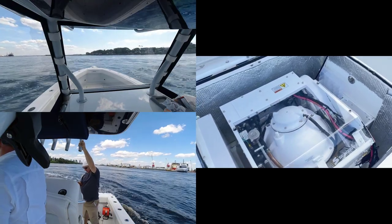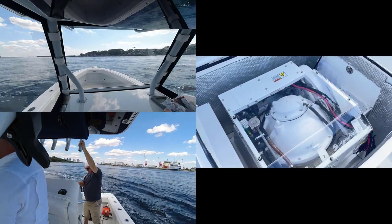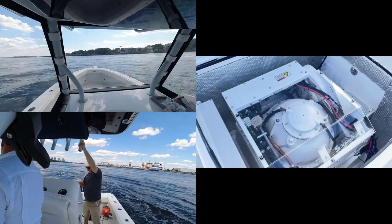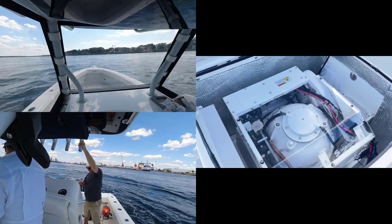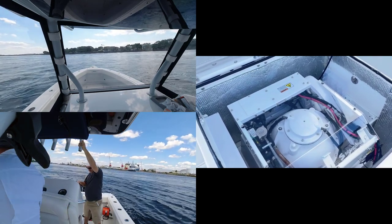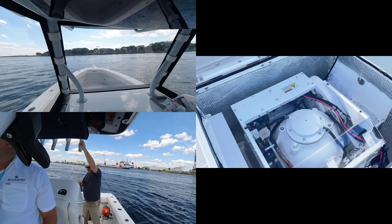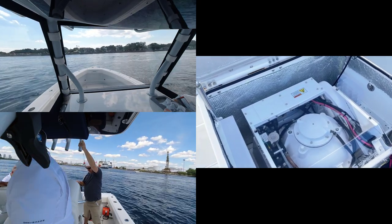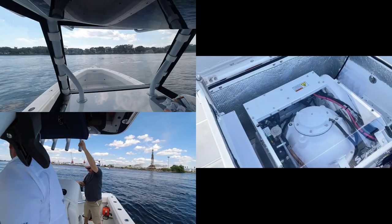Now you'll see, as the waves are hitting and precessing — so it's a starboard side roll, the ball is going to precess forward. And if it's adjusting for a hit by a wave on the port side, the ball is going to roll out. And that just has to do with the direction of the flywheel spinning and which way it's exerting the force into the gimbal.